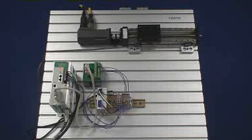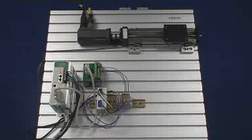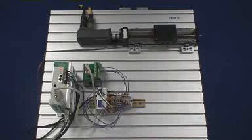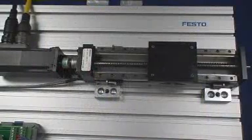This drive comes standard with Ethernet and DeviceNet, with PROFIBUS as an option. The programmable drive can also function as a Modbus master, so up to 256 digital inputs and outputs and up to 100 analog inputs and outputs can be added.